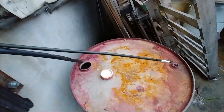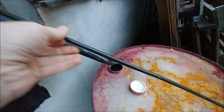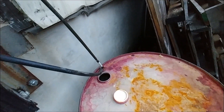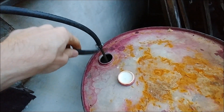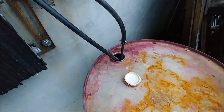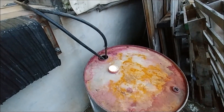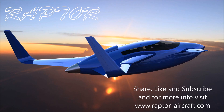Here's my fix for the 55-gallon drum. I bought some brake line, cut an opening about three inches up, and crimped the end — so the tube pulls cold water from the bottom of the tank while the other line returns the hot water at the top. That should give us a good flow of cold water. I didn't get a chance to run it again since the filter got pretty dirty on the first run, but I'll run it again before the end of the week and have an update on the weekend. That's our update for the first half of this week — thanks for watching.